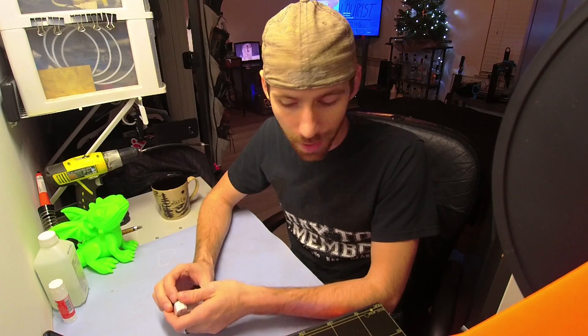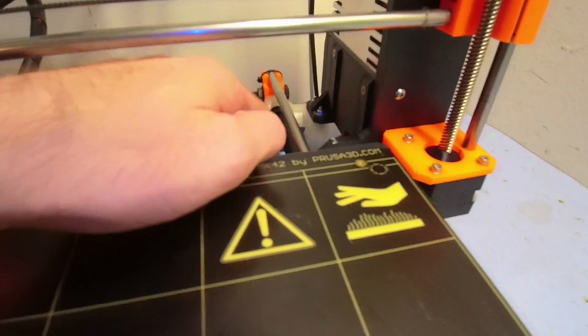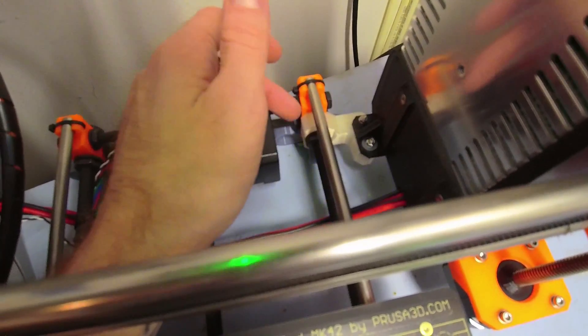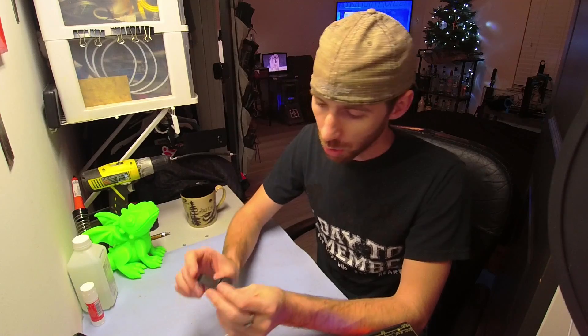The first thing I didn't like was the power supply would not mount up with the bracket. I followed the manual to a T and it still wouldn't line up. They say there's supposed to be 100 millimeters between the gantry and your back Y corner plate, and I had that distance but the power supply still wasn't lining up. I figured they either changed their manual, left something out, or the dimensions on this part changed since they started shipping it.